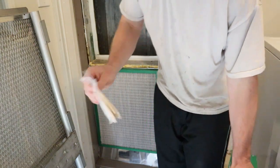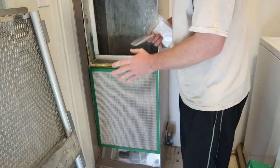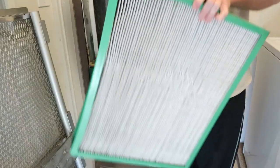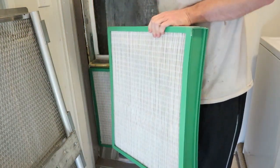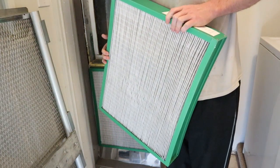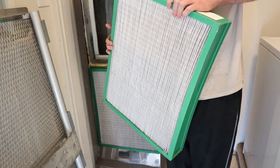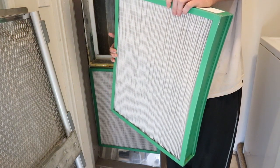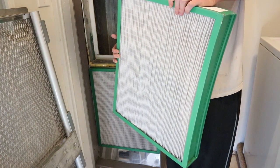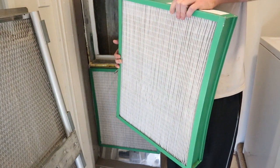I made a little pocket up here — you compare the color of that to the color of this to know when to wash it. The estimated time between washings, assuming two filters in parallel and not a single filter, is one and a half years, and it looks like that might actually be fairly accurate. These filters are rated for four washings, and I don't know if the resistance increases or decreases at that point, or if the filtration is perhaps inadequate to match MERV-15 at that point. Why is it only rated for four washings — is that for warranty issues? I don't know.